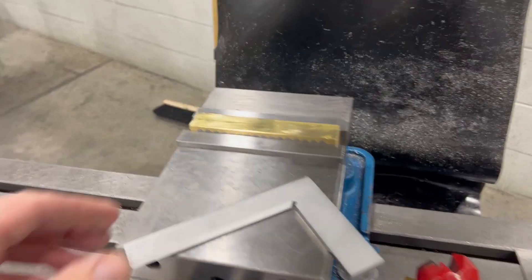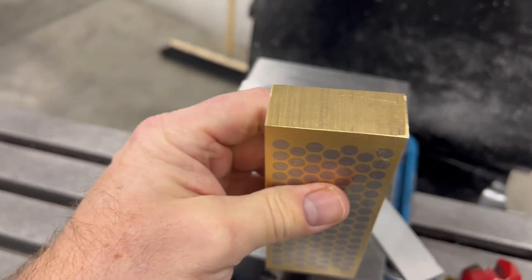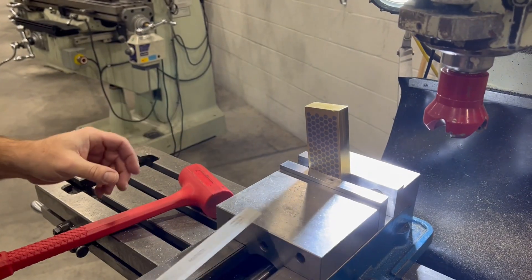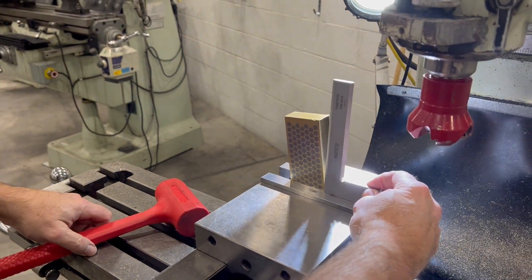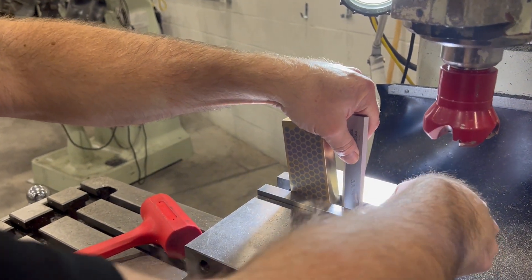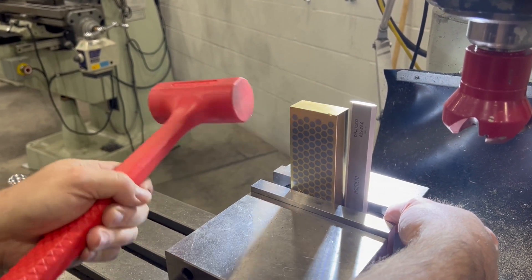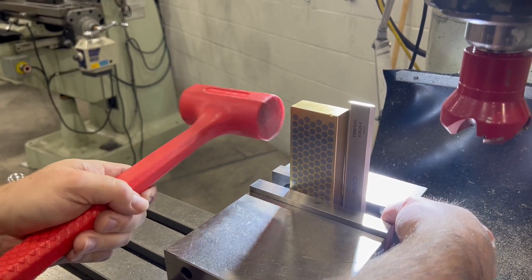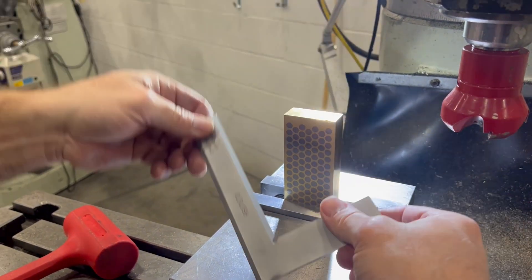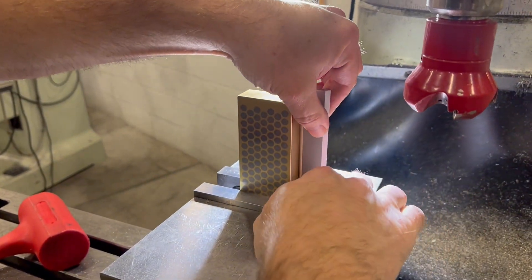Adding the chamfers. We're going to face off the outer edges, remove a couple slight imperfections, then stand up and square them. I'm putting the work piece in at a skewed angle and nipping the vise up so I can move it without damaging it. I push it up against the square and tap with a hammer until I see no light. Just keep tapping gently — almost no light, no light. Now I know it's square, so I tighten the vise down and double check again to confirm no light coming through.